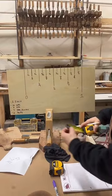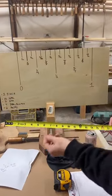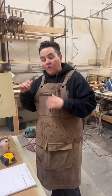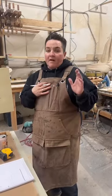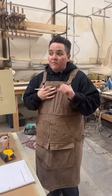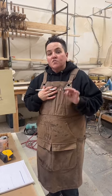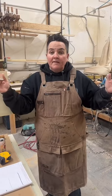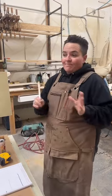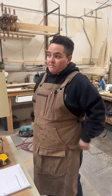A standard tape measure that you're going to find around is going to be broken into 16ths. Most of you aren't going to do that fine of work where you ever need to go smaller than a 16th to like a 32nd or a 64th. It is very rare in my 25 years of cabinet making that I've ever really had to use 32nds or 64ths. Sometimes they can add up if everything has to be precise in a row or in a line, but for the most part, that's not what most people doing things like this are using.